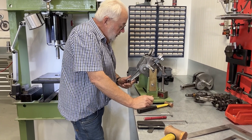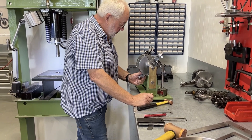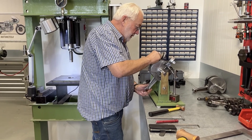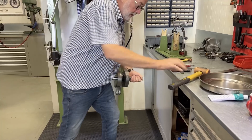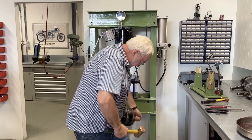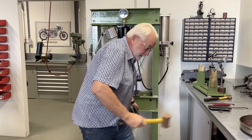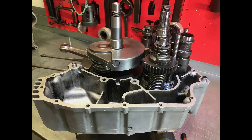What we're looking for are the high spots and the low spots, marking these so we get an idea of how the crankshaft should be moved — or how the web should be moved relative to each other — in order to get it aligned properly. That is done with a heavy copper hammer and some blows in the right place. And here you can see the end result of the finished crankshaft.